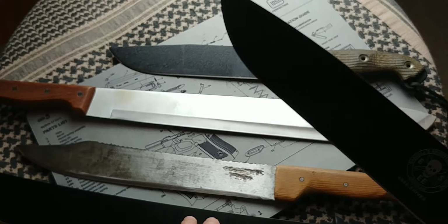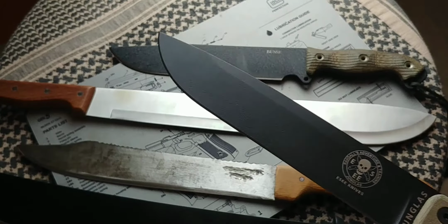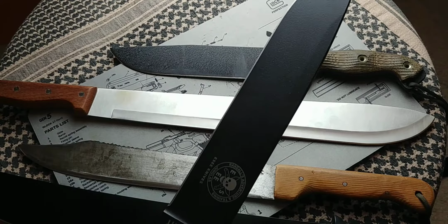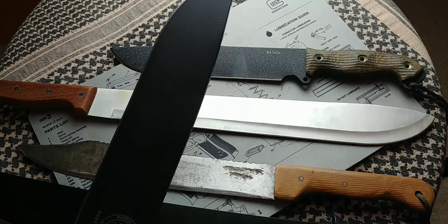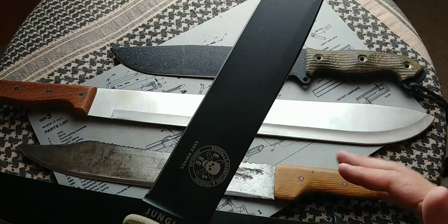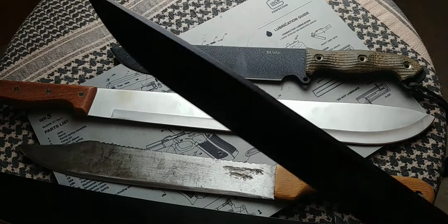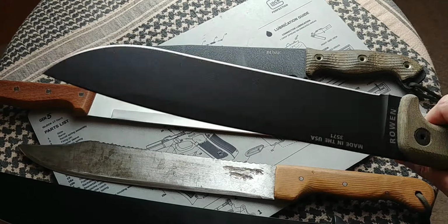So some of the cheaper steels are actually tougher than some of the more expensive steels. That's why you sometimes see some of the torture tests in which a crappy cheap knife made of some of the cheapest steel, maybe a 420 or 420 HC or a 1055, takes a lot more abuse than a 1095. So what's that about? Well, the thing is that 1055 is going to be taking more abuse, but it's not going to be holding an edge as nicely as your 1095 steel.